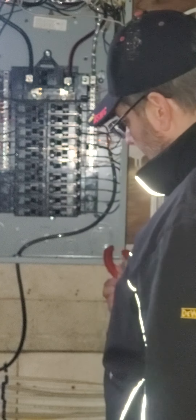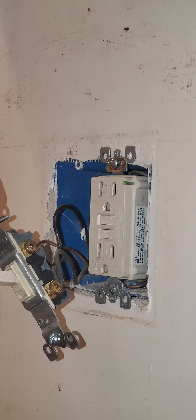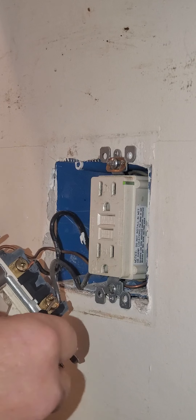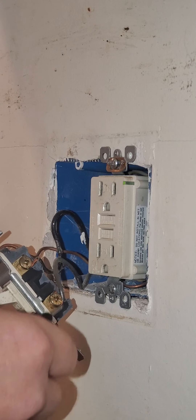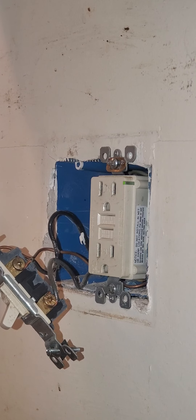Now I'm checking to see if we're getting power at the plug-in cord. We know now that we don't have power down to the plug. This is the switch — this has power. So coming from downstairs up as we trace all this, we're getting the 120. When they flip the switch back to off it shuts off, put it back on it's traveling — we're getting 120 here. So this now takes me to the disposal and the outlet itself.